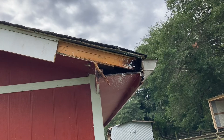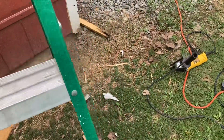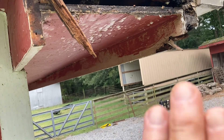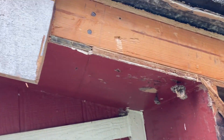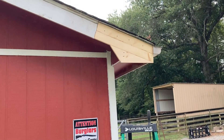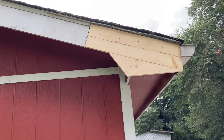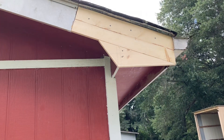Okay it's all cut out. This is the hard part — constructing a new piece and nailing it in there will be the easiest. You can see the rafter is a little bit rotted but certainly not worth messing with. At some point I need to take the flat piece that goes all the way down that way — that's what's mostly rotted away — and we'll cut a new piece, construct it, and piece it in there. It should be easy. After an extended amount of ciphering and cutting it to fit, I got the angles correct. It all matches up just right. I've got to caulk it, caulk the screw holes, bend the flashing back down, caulk it and paint it white.